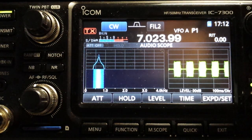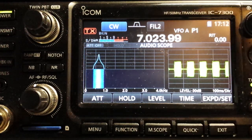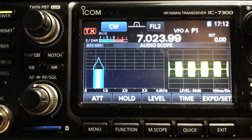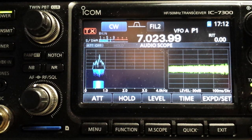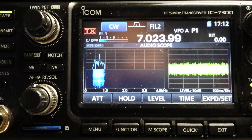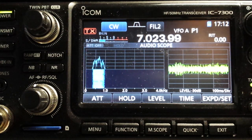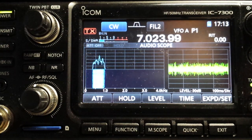It's a little bit of a spike right there. It's not necessarily the fault of the transmitter — the DSP in the receiver actually shapes it that way. Some people say it's harsh sounding, and that's a pretty common problem that DSP receivers have. Crystal filters tended to round that off and make it sound a bit more soothing. DSP doesn't.